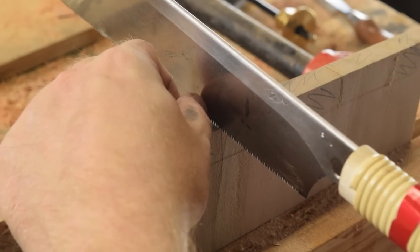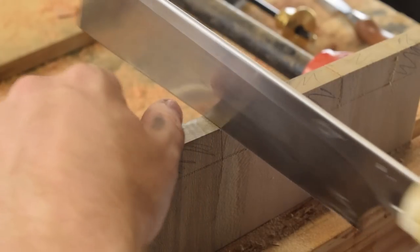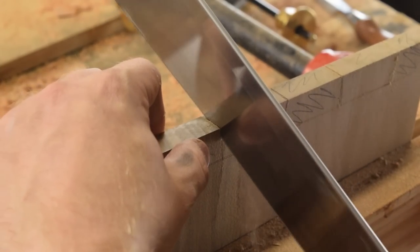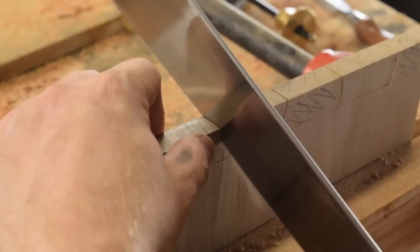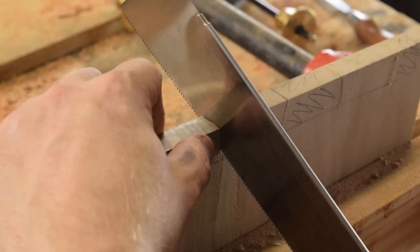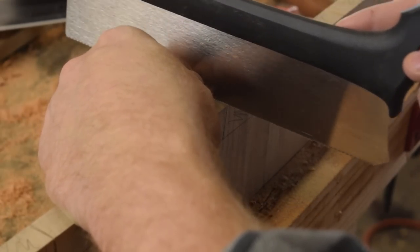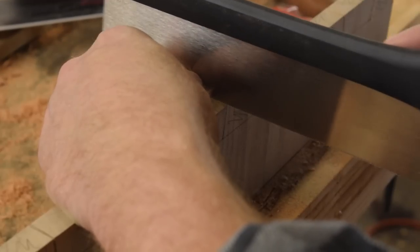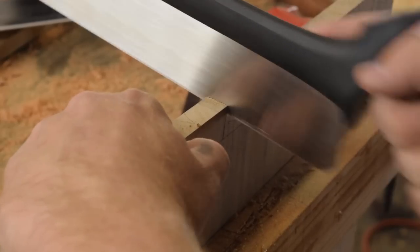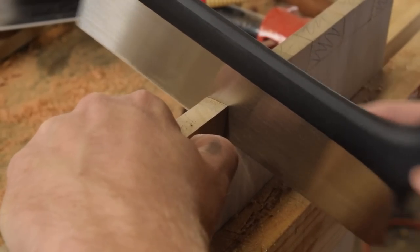This is a fairly minor point, and it can be corrected with practice, but I tend to find that the Dozuki starts a lot easier on any cut than a Western backsaw. The pull motion of the cut is just really natural for getting a cut started. Even with a Western saw, you tend to start your motion with a back cut. With practice and confidence, you get faster at either version, though. Not that big of a deal.